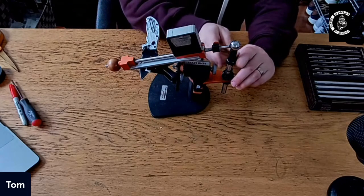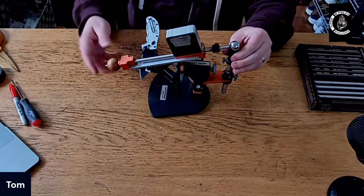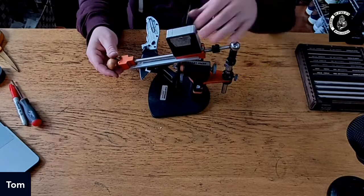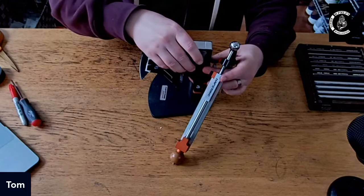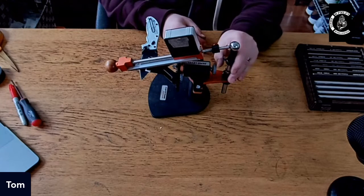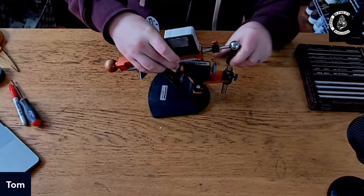It makes it more precise, and I just know where to strop at. Changing the strop thickness just a little bit changes the degree on this significantly, like a whole degree. Well, we bottomed that out. We're going to have to go back up and use the big stopper.